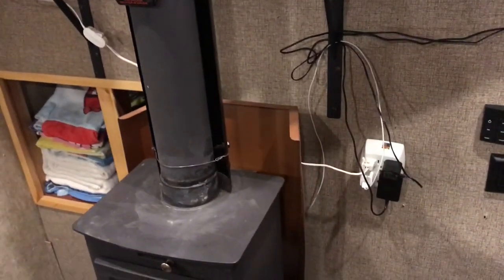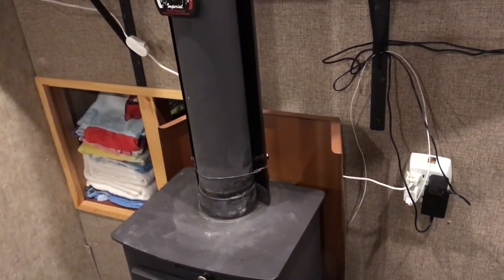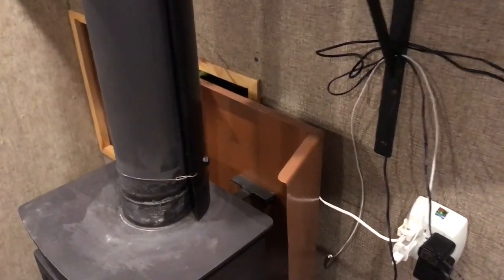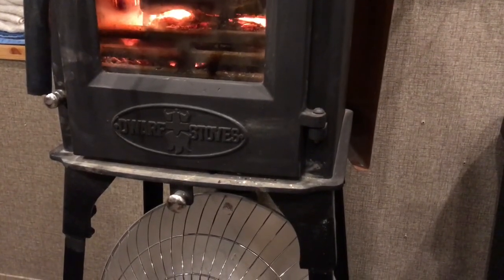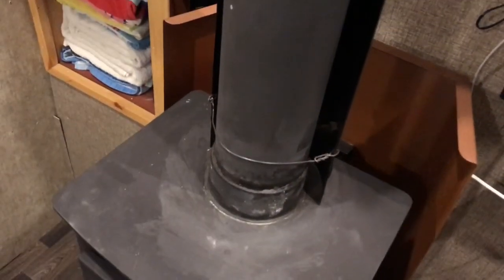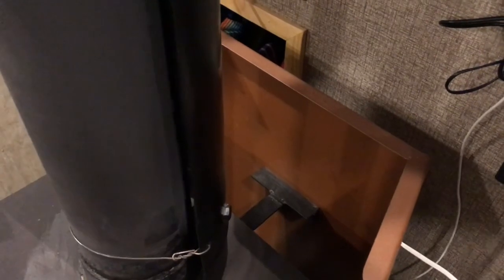On the back side there are prescribed clearance distances for how far you should be from combustibles such as wood walls. I took a piece of 24-inch by 24-inch sheet steel, bent it with a brake, and welded some standoffs. I welded these directly to the feet rather than compromising the stove body itself, since the legs are just bolted to the bottom and could be replaced. The stove has the option of the flue coming out at the top or the back, and I welded the standoff onto the secondary flue outlet, so it would be fairly easy to remove if needed.